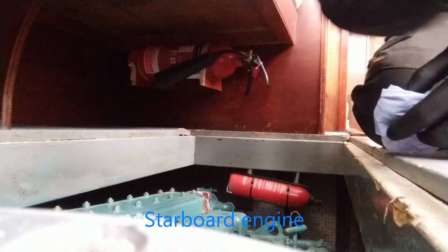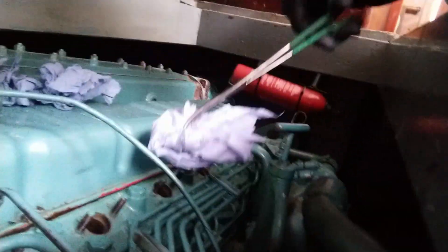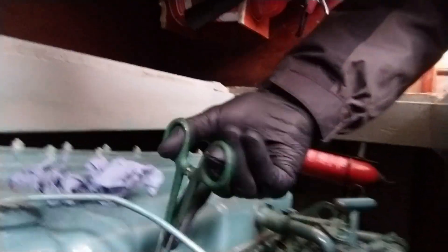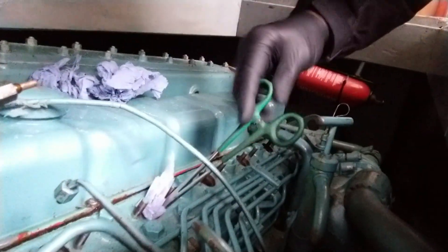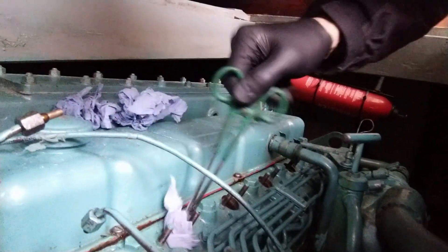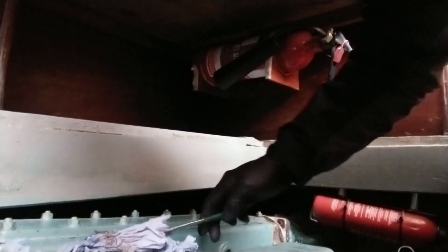Here at the engine now — basically what I've got to do is put a bit of paper towel down in each of the injector ports, just to make sure there's no contamination down there. You don't want any grit or grime caught between the seal. I just use a pair of tongs — can't recall the other name — grab down and get all that gunk and rubbish out. Have a little look in there; it looks clean. Repeat that six times per engine, twelve in total, then fit the copper washers and torque down.